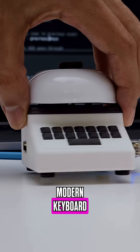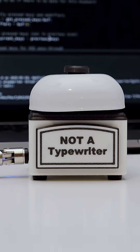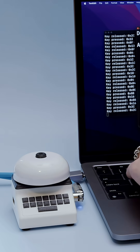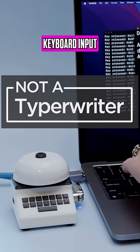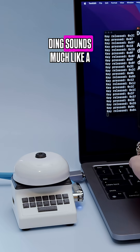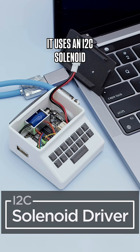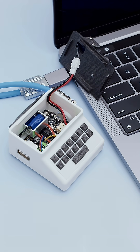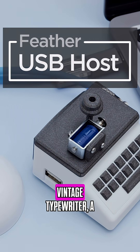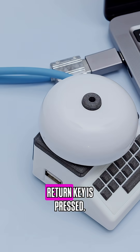This project makes your modern keyboard sound like a vintage typewriter. The NADA typewriter is a little add-on device that takes your keyboard input and triggers solenoids to make clicks, clacks, and ding sounds much like a typewriter. It uses an I2C solenoid driver board and an Adafruit Feather RP2040 USB host running CircuitPython code. To capture the essence of a vintage typewriter, a small service bell sits atop the device and dings each time a tab or return key is pressed.